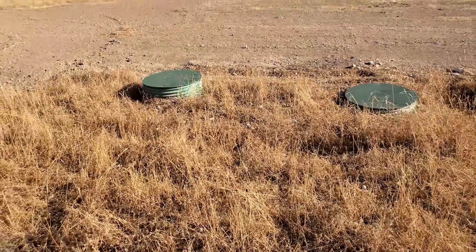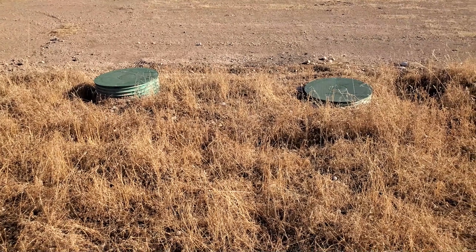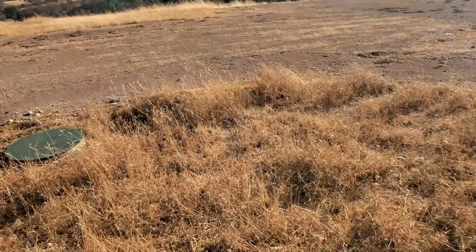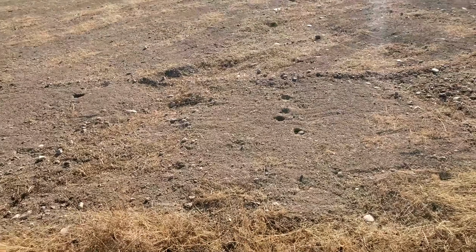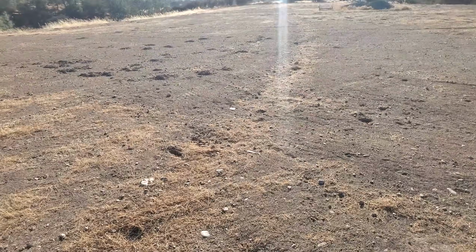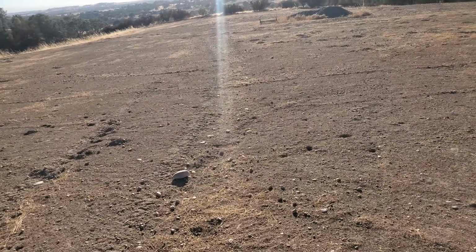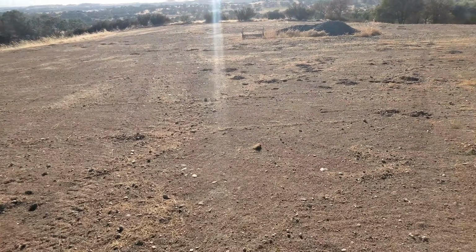And then this tank is of identical construction. This is the one that we're connecting all the plumbing to today. Down all the way across the entire hill is where we ran to. So as you can imagine, making grade is a little bit tougher. So then those two, you can kind of see right here is where it's sunk down maybe. It comes over here, it's got one more trench that runs along here. And there is then a splice box or distribution box, and that's what then goes to the leach field.